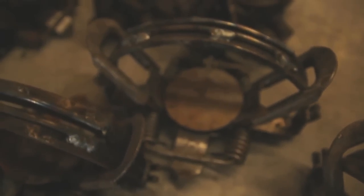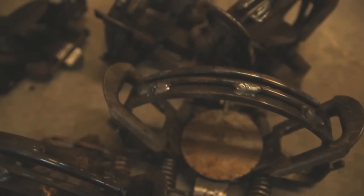There's gonna be a little bit of slag left on the lamination kit and on the jaws. You wanna go ahead and grind all that stuff off there because you don't want any sharp edges, nothing gonna catch on the fur of that animal when he gets caught. So we grind all that off, and basically now we're ready to prepare that trap for next season.